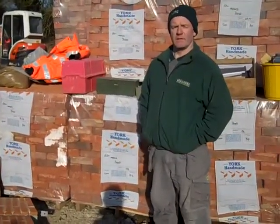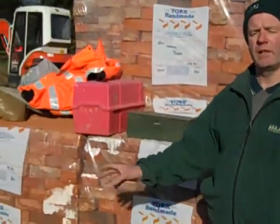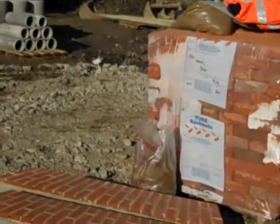It's the month of March and the bricks are going up. Something special with the brick arches — they're called flat gauged arches, and they've been made using a precast method, meaning the bricks are cut to shape and bonded to a precast concrete lintel. We're able to point these arches up on the ground and then lift them up and place them in position above the window heads.